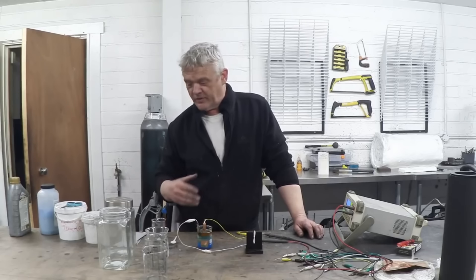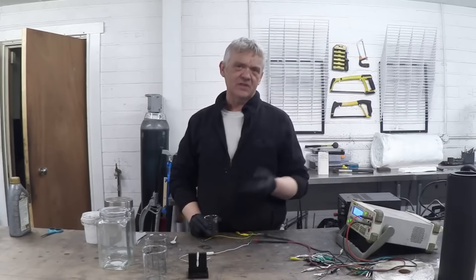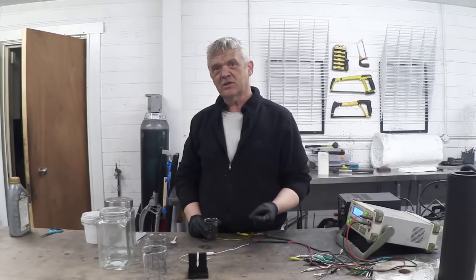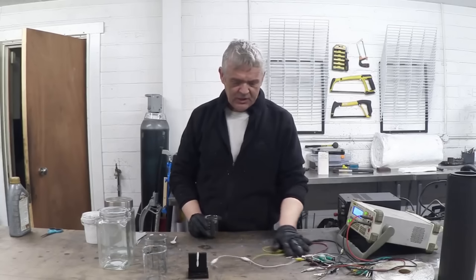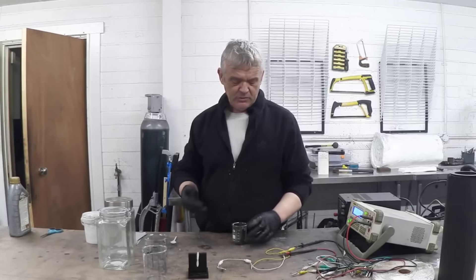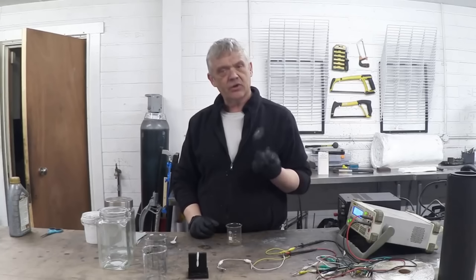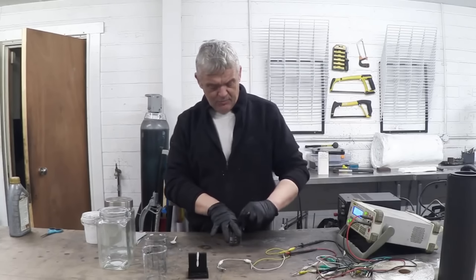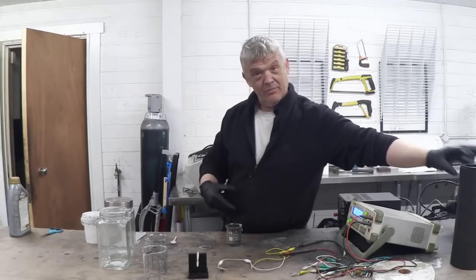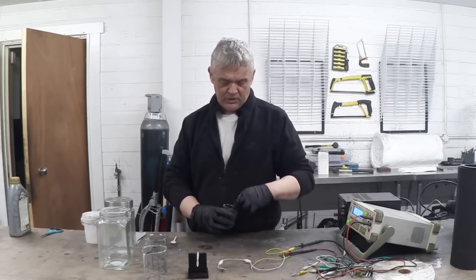Now I'm going to move to the second gravity battery, which is a rechargeable version. The copper-zinc is rechargeable in a mechanical sense; this one is rechargeable in an electrical sense, connected up to a power supply. It uses zinc bromide. The setup is a jar with a carbon electrode — a bit of metal glued onto HDPE (high-carbon-filled HDPE) to protect the metal, with carbon painted on top — which is circular and sits at the bottom.